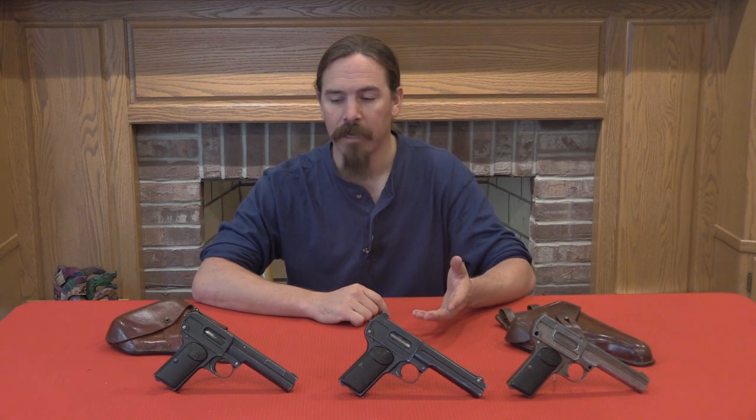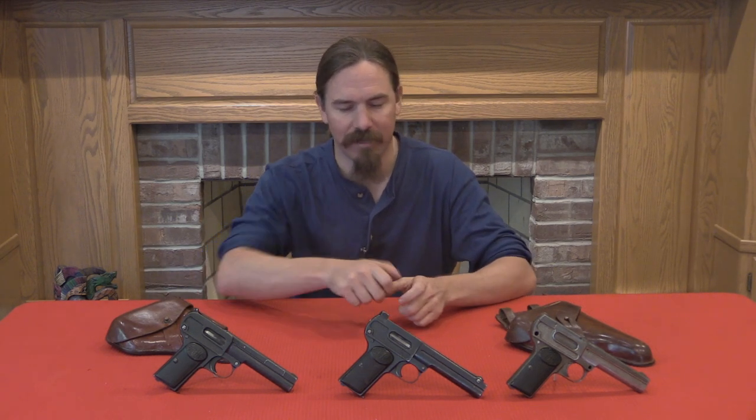In order to do that with a blowback system, you either need to add a lot of mass to the slide, or a lot of strength to the recoil spring — something to balance the extra power going out of the barrel with extra inertia keeping the breech closed so it didn't open too early and explode. The way Schmeisser decided to do this in the Dreyse 9mm pistols was to make the recoil spring ridiculously strong. In fact they were so strong that you can't really cock the guns by hand — you just can't get enough grip to do it. So the solution was to put in place a mechanism to bypass the recoil spring in order to load, unload, or clear a malfunction. This makes sense.